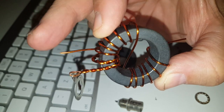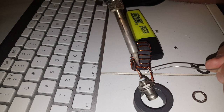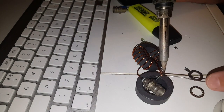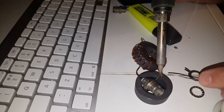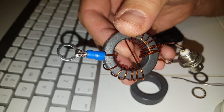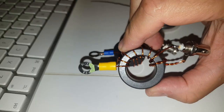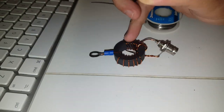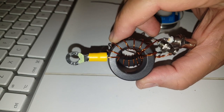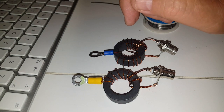The center of the BNC goes here, the ground lug is here, and the antenna wire is here. I'll solder the BNC center connector and the ground lug — this is just temporary because ultimately it will go inside a box. I just want to determine which of the two transformers works best. The second one has two turns primary like the first, but eight turns total — a 4-to-1 ratio, and 4 squared equals 16, so this should be a 16-to-1 transformer. I have no idea which one will work best on six meters; I just have to test them.